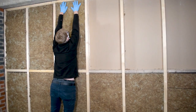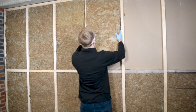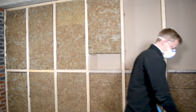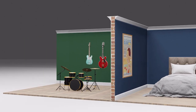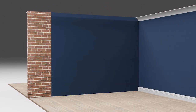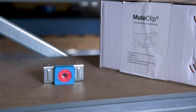The first step for a stud wall is to install acoustic mineral wool into the open cavity spaces. Mineral wool is a dense material and holds its shape — you can cut a smaller piece to fill the top of the wall, pack it snugly in, and it won't drop or sag. For a brick wall soundproofing job we simply swap around step one and step two, as a brick wall doesn't currently have any cavity space.